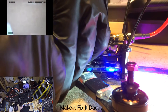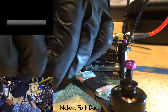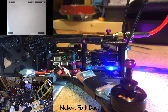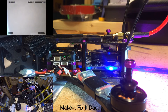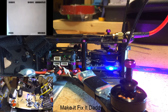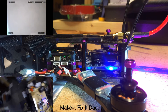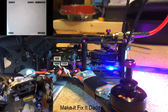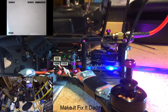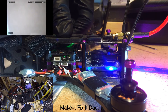I'm going to unplug it and plug it back in. We get the TBS Core PNP 50 amp version 1.0 — that's what I have. I have nice black bars, my RSSI is on, and you can see it was registering 0 and now it's registering variable because I'm between my TX and my RX. Now they're adjacent to one another so there's probably a little interference, but at least it's showing accurately. And that is how to set up the TBS PNP50.